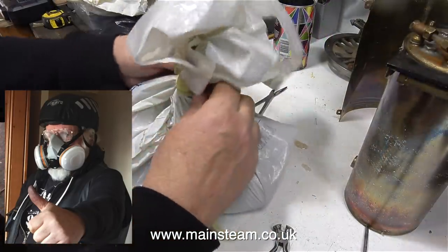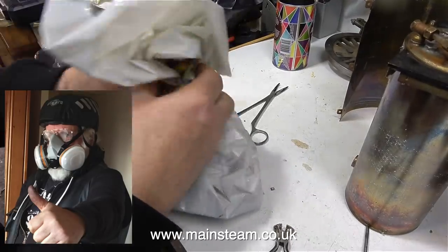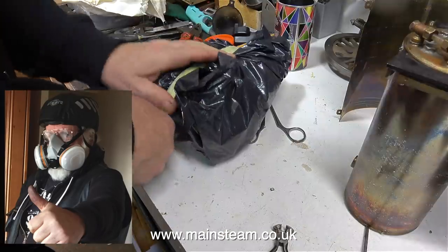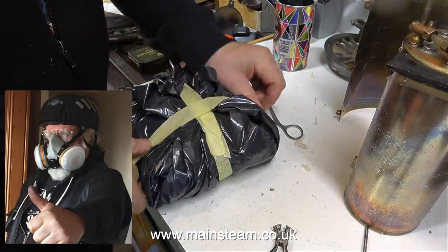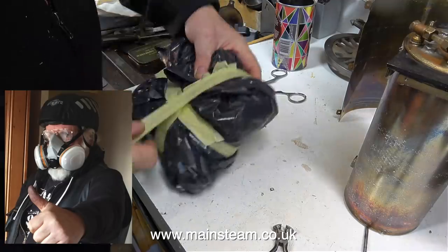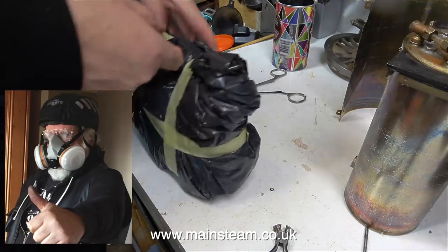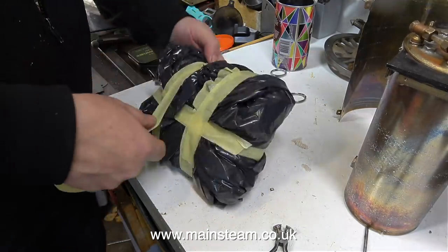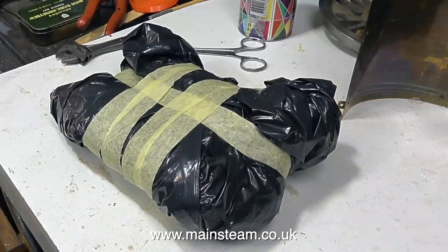So, how do you dispose of asbestos? Initially, I'm putting all of the asbestos I got from this boiler and casing in a plastic bag, but this is not the way to do it. I typed 'how to dispose of asbestos' into Google. Regulations for the disposal of asbestos may be different in various countries. In the UK, it tells me that I need to double bag the asbestos in very thick plastic bags and then seal the thick polythene bags using strong adhesive tape. I'm only showing it this way for the purposes of the video, explaining the procedure as you see the images.